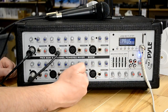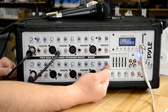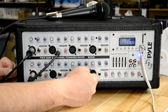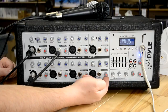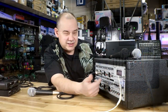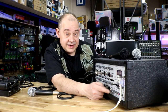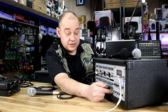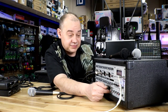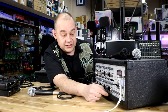When I unpack one of these units, the first thing I like to do is take the blue knobs — which are the bass and treble controls — put them all at 12 o'clock, turn the effects down to zero, and turn the gain, which is the red knob, down to zero. This way if I've done that across the whole board, it's not something I have to remember. The idea of keeping gain down on mics or inputs you're not using is so you're not adding extra noise to the system. Every time you leave one turned up with nothing plugged in, it's going to add a hiss in the background.